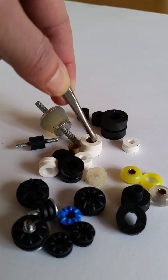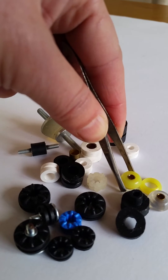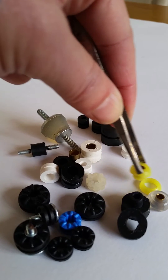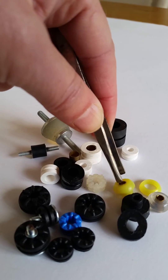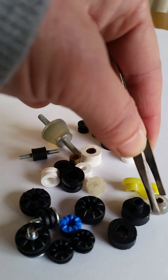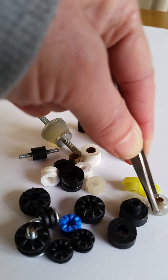We've got a number of two-part grommets. These are 11mm diameter — that's a sort of firmish gel in a two-part design. These are ideal for variable plate depth, say a deeper PCB or deeper chassis. This is the same size again, 11mm, but in a very, very soft formula.